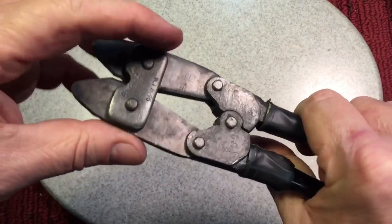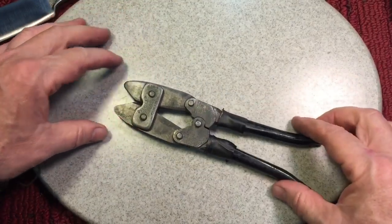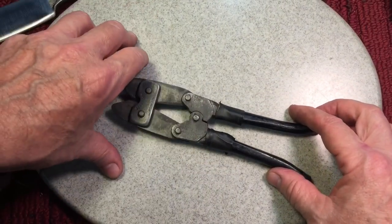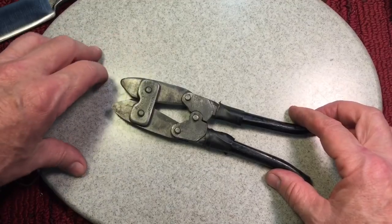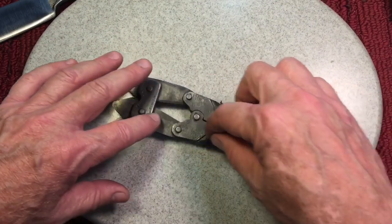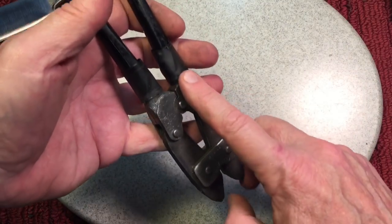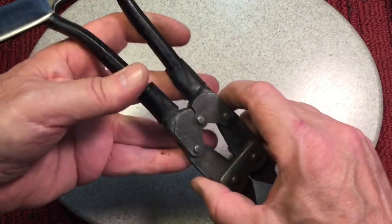You know, we went through it with the wire brush and then the Dremel, got all the dirt out of here. Now we're going to hit it with the 50/50, which is half acetone, half automatic transmission fluid, and we'll leave the tape and everything on because we don't want that getting under the grips. We'll spray it upside down. You don't want the 50/50 loosening up the grips, so we'll see what we can do here.